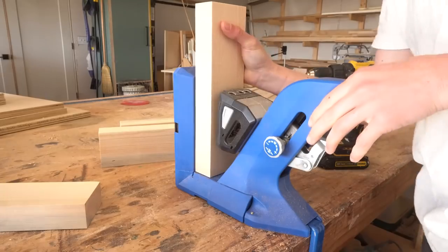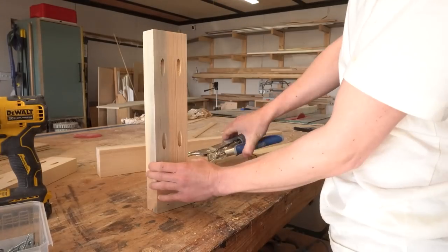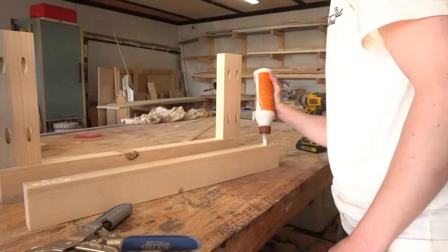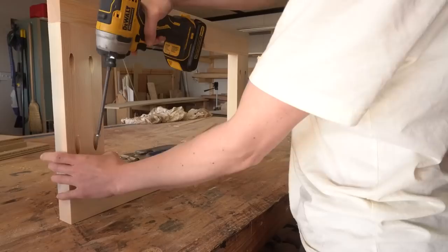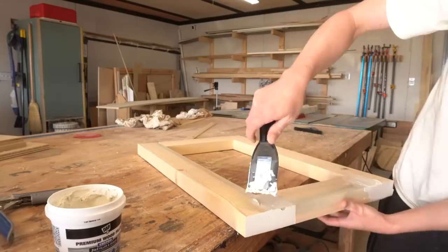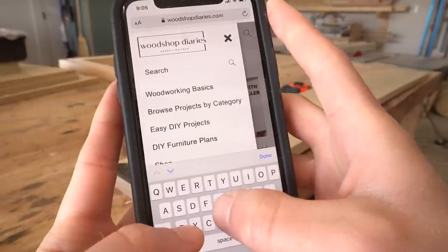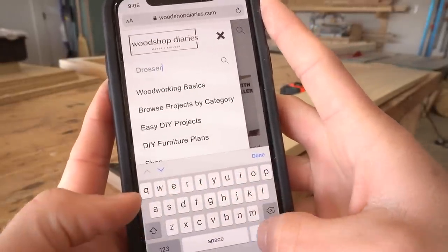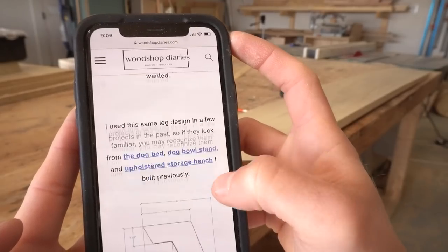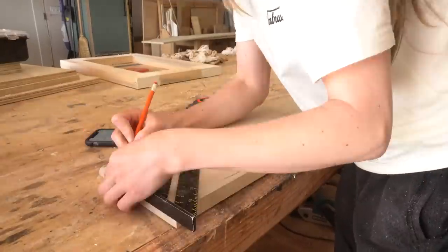I built the base next, which consisted of a 2x4 frame with mid-century style legs attached to the corners. I cut down my 2x4 pieces and assembled a frame using pocket holes, screws, and wood glue. I puttied over the joints on the frame and shelf frames, and while it dried, I cut out the legs — these may look familiar if you saw my mid-century modern dresser video, as I pulled them from those plans on my website. By the way, I have a website full of building plans plus guides on things like building drawers, applying edge banding, and sizing cabinet doors — I'll link it below.